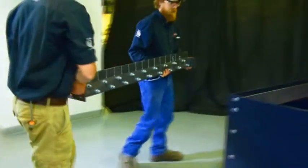Your table slat carriers and your table slats are not painted. This will provide a good ground when plasma cutting. The center slat carrier goes in next.